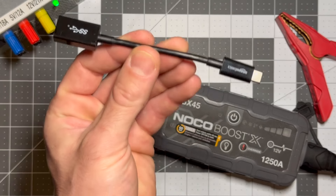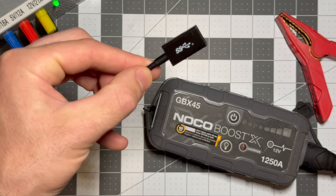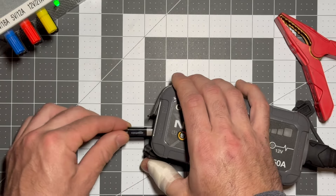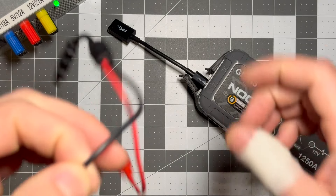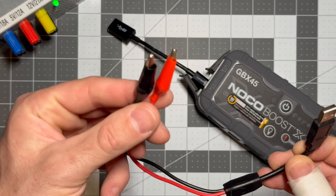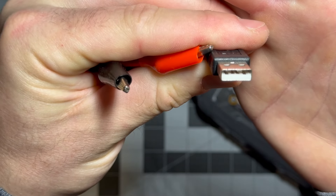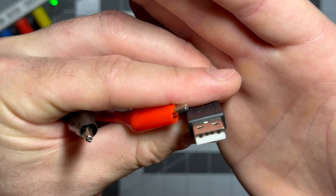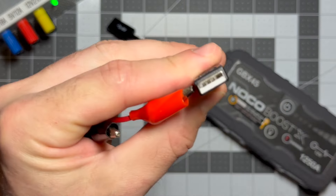I need two little cables. First is a USB-C to USB-A adapter — this one's a super speed data capable cable, but that doesn't really matter, I just need the power to flow through this. So I'll plug in the USB-C side into the NOCO boost. The next thing I need is this really cool little cable adapter: it's USB-A to a positive and negative lead. USB-A is dead simple — it's just got four lines inside. The outer two are positive and negative and the center two are your differential data lines that actually send the serial data down the line. So this cable leaves out the data lines and just connects up the positive and the negative.